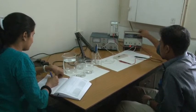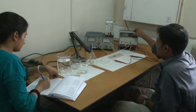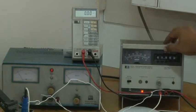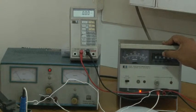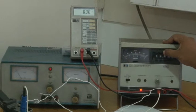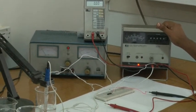Gradually, with increment of 0.1 V of reference voltage, we apply the voltage to the gate through the reference electrode and observe the change in drain current.